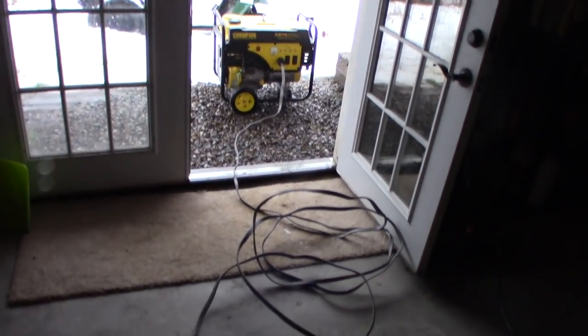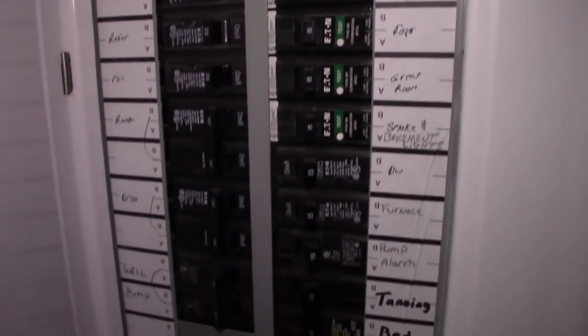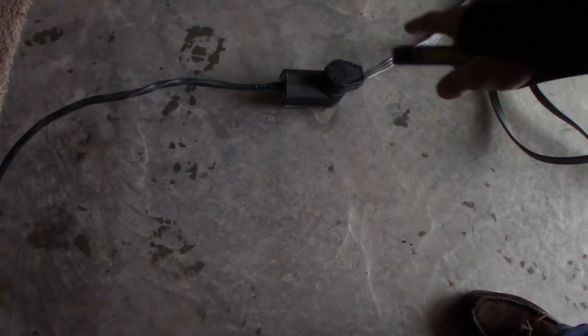We should now be connected to the house with the generator via 220 volts. Now it's probably a great time to go back over to your power box and make sure that your main breaker is shut off, every other breaker is also shut off, including your generator input breaker. Now we've actually got to start up the generator. As soon as this particular generator starts, it begins generating power. If that plug I showed you isn't actually plugged into the receptacle, it becomes charged with 220 volts of electricity — that is why you make all your connections before starting anything. Better safe than sorry. Let's get this generator running and get the power turned on.